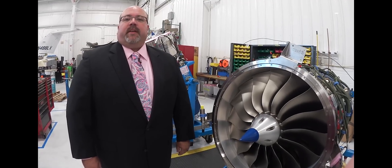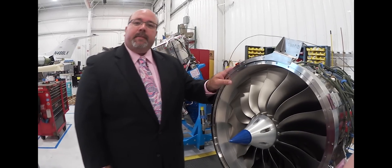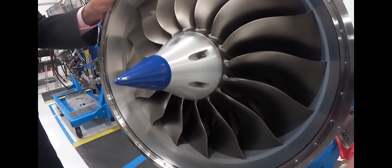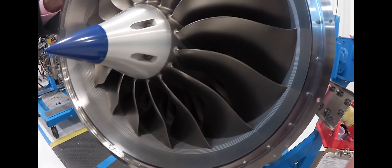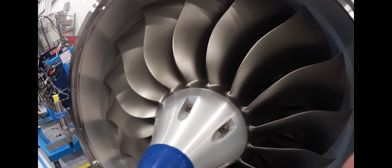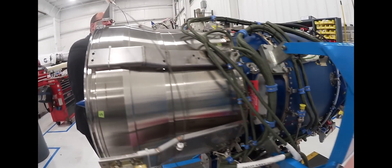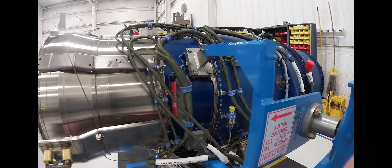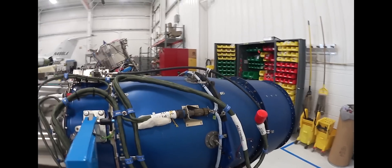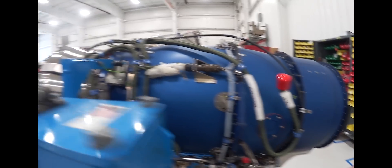One of the most significant improvements in the 400XTI remanufacturing process is the FJ44-3AP engine. This engine is a significant part of the advancements not only in technology but in efficiency. What you see here is a solid piece of titanium milled from one piece in the fan section. It is a close-tolerance engine; the efficiencies are driven by that plus the pre-cooler aspect of the engine. When we receive it, it comes in as a core — no accessories, no harnesses, no fire loops. The harnesses are built in our back shop here, the accessories come off the former Pratt aircraft, and all the digital upgrades including the FADEC are new technology.